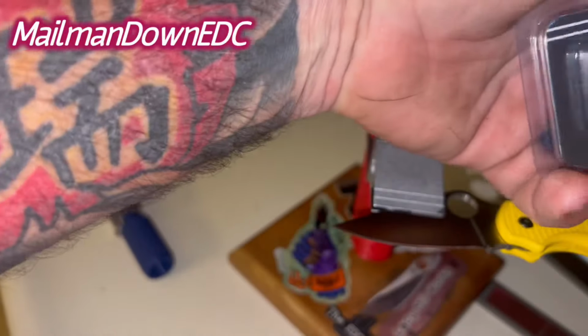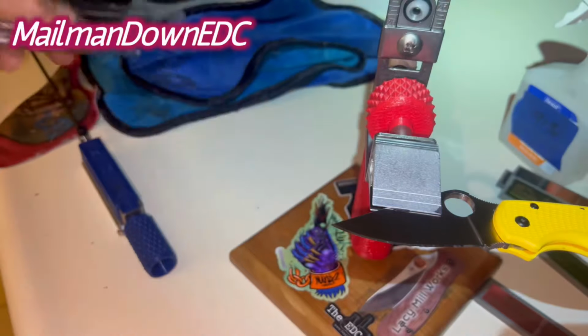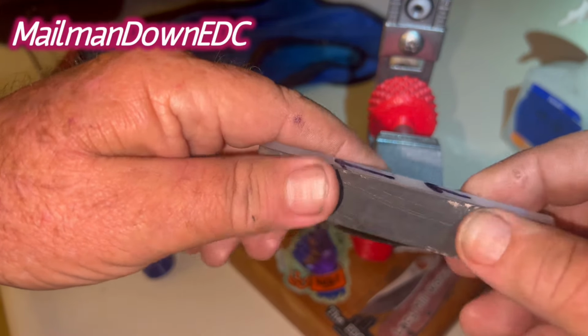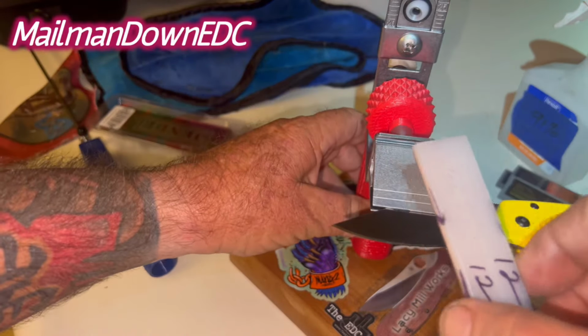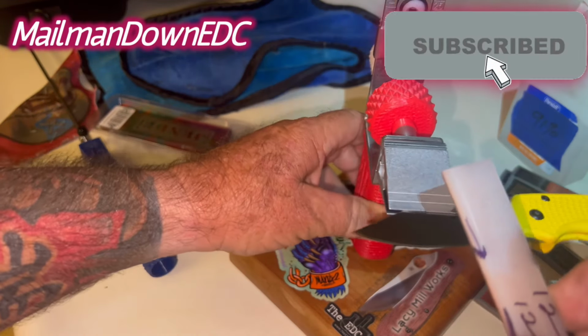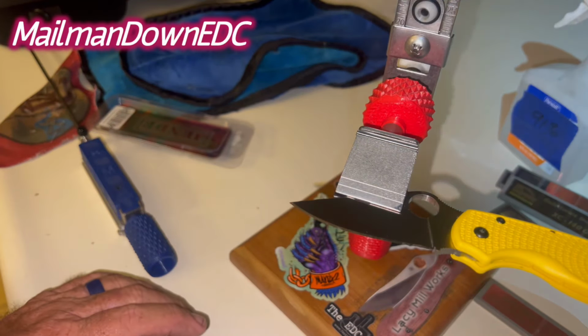And I've got these kangaroo strops right here. These are kangaroo leather strops. And they are almost the same thickness as these Columbia Gorge Stoneworks. You see there's kangaroo leather. I got to redo these, by the way. Kangaroo leather, but it's got the gunny juice on them. It's loaded with gunny juice. But thickness is about the same, so I don't have to make any adjustments. So when I run these things down there, oh my God, man, it shines. It polishes this edge. That's what gives me the mirror edge.